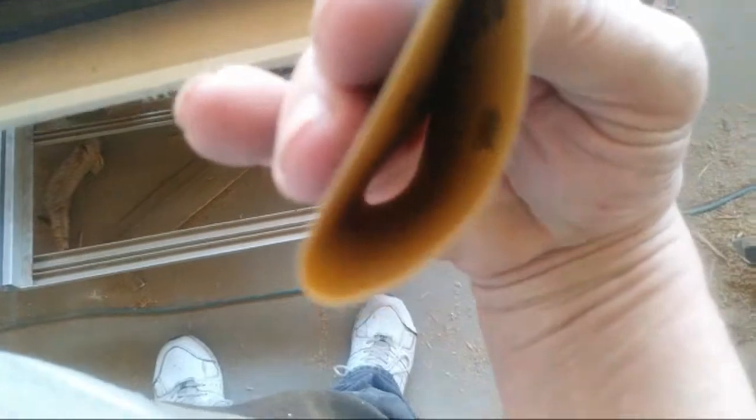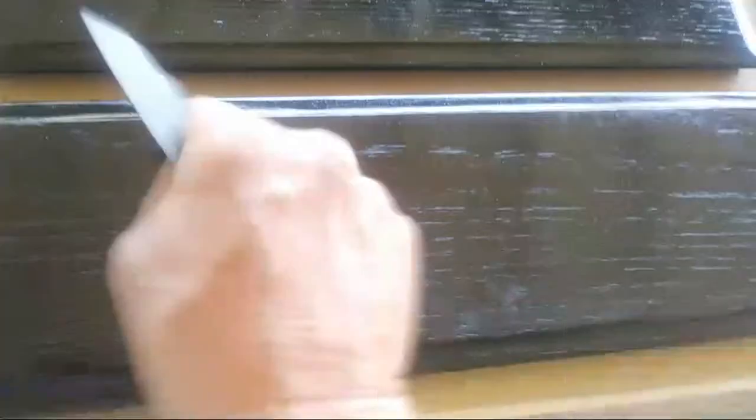And then I'm going to lightly sand. Okay, I got that cushion there, right? I'm just going to lightly sand in one direction. You're not going back and forth. We're going in one direction here, so that we're just taking off the rough edges, any spatter from the stain. All right, and that's all we're doing, is just removing the roughness from this door face.